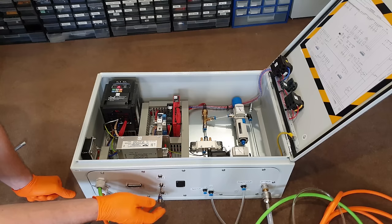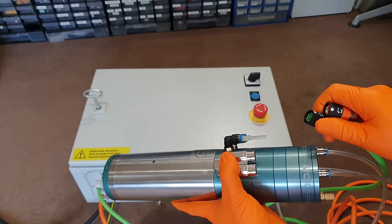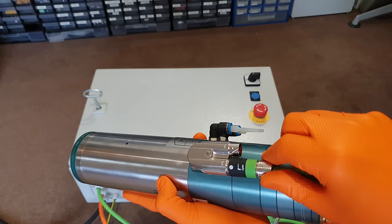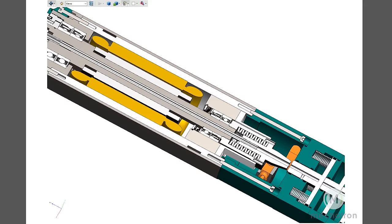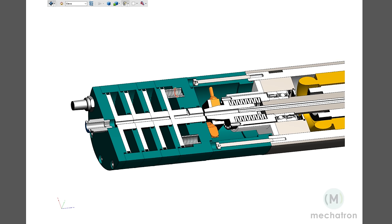To find out where exactly the three original air outputs are going, I'm afraid we have to perform another violent spindle teardown. This beauty is going to be a challenge, being all full of pre-loaded and precisely torqued precision parts and sensors. These connectors alone are absolutely stunning. Time for the first high-end spindle teardown on YouTube — but in the very last moment I got an email from the manufacturer with an incredible 3D sectional drawing. That way we can do it all virtually and safely. At the top there is a series of pneumatic ejecting cylinders, reset and held in position by spiral springs. When the cylinders are pressurized, the springs are overpowered and the central rod is pushed downwards.